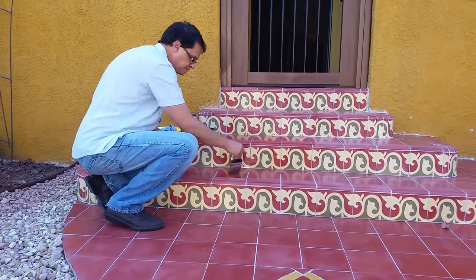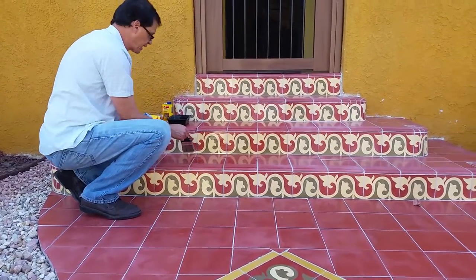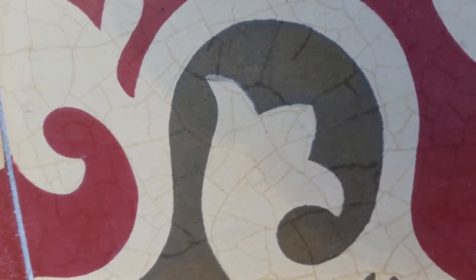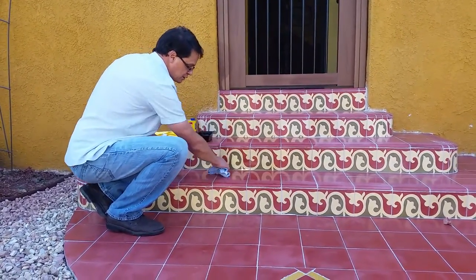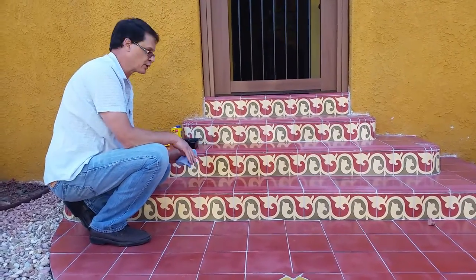We're just going to brush on a little bit of sealer onto the tile. On a second coat, make sure you avoid getting too much on, because the tile won't soak it up the way it does on the first coat. You may notice some crazing, which is very common in cement tile especially when it gets wet or you add sealer — as the tile dries and the sealer gets absorbed, the crazing will be less apparent. If you see any pooling or running, gently rub it down. You don't want any streaking or pooling. Once you finish a section, move on to the next — and that's really all there is to applying sealer to cement tile.